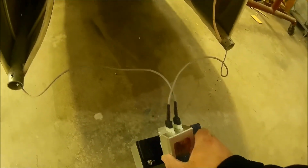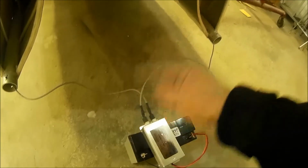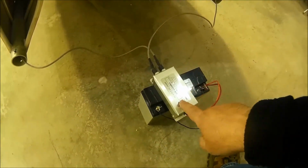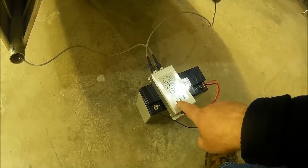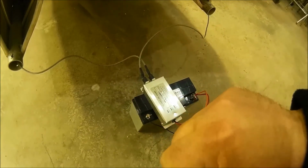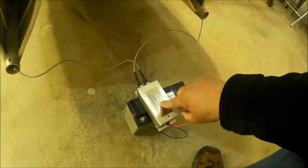Now, if you've got a tail strobe or a beacon, they sell a little Y adapter that you would then just keep on adding on and adding on to this controller. And in the instructions, it tells you to hold the magnet about here for a second and let it go. So you're watching your strobes, you're watching them flash, and then you keep on doing that till you get the flash you want. I wanted the triple flash. This is a 12 volt DC model, and it's pretty well foolproof. As you can tell, works great. Very happy with them. And it's by Kuntzleman, and I purchased them at Aircraft Spruce.